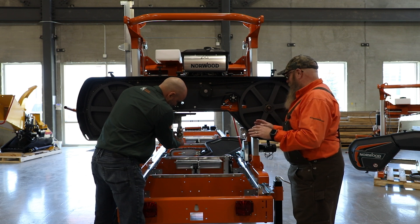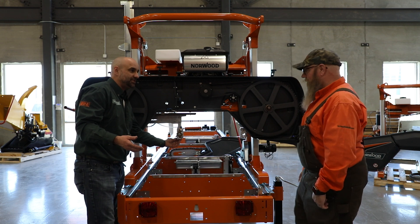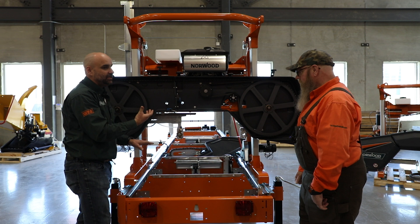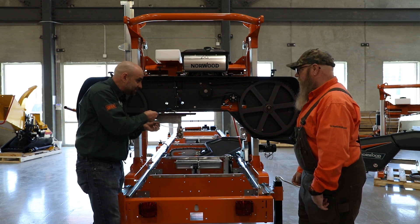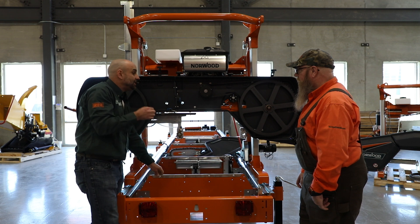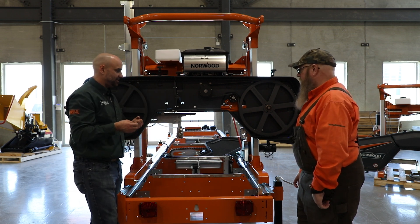Whole different world of adjustment — just next-level tuning on your HD mill. When we set that lower ceramic up, we're going to do it just like when you had your ceramics on your HD36 or HD34. You want to have a little bit of light between the ceramic and the bottom of the blade — we don't want to rub it and create heat that deteriorates blade life. Just a hair. Some people use a thin piece of paper for spacing. And make sure that the ceramic is centered on the blade body, so when the blade goes back that sixteenth of an inch, the teeth don't start hitting the ceramic. You want the back of the ceramic to be just right near the flange on the roller guide, and then you're set up perfectly and ready to cut.